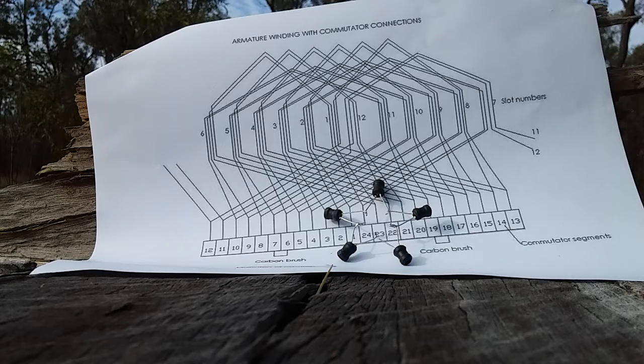The schematics and diagrams of the universal motor show what's going on. The carbon brushes show that on the commutator segments, at any one time, there are two coils connected directly across the carbon brushes. The rest of the coils are in series — high impedance, high resistance. So the current is not going to flow through the high resistance the same as it will flow through the low resistance.